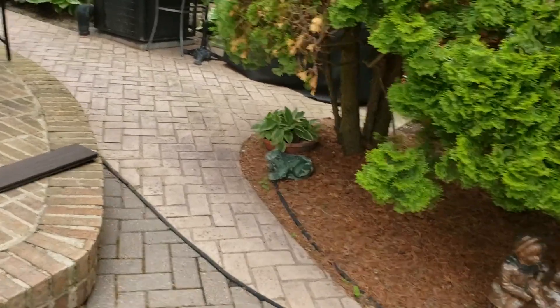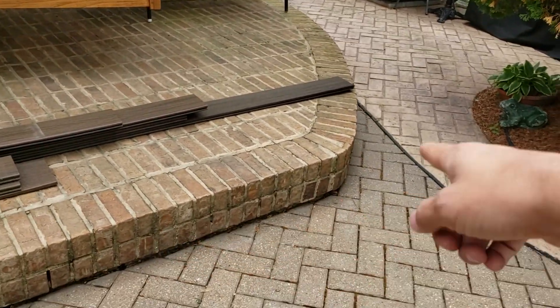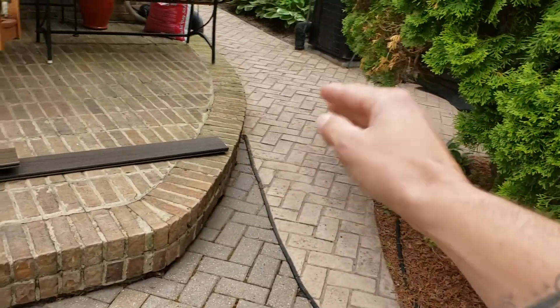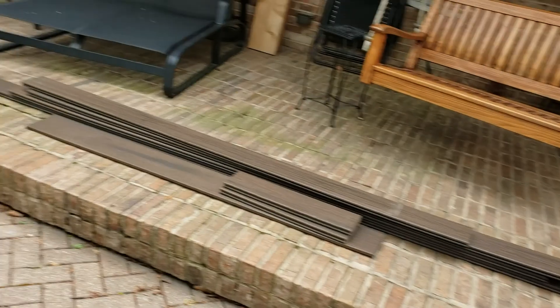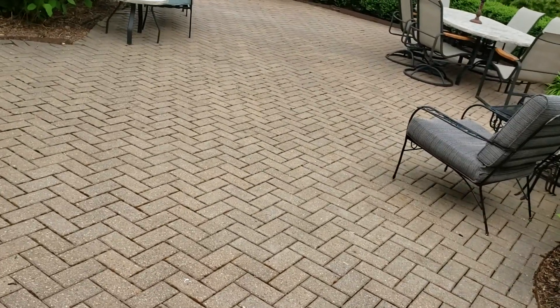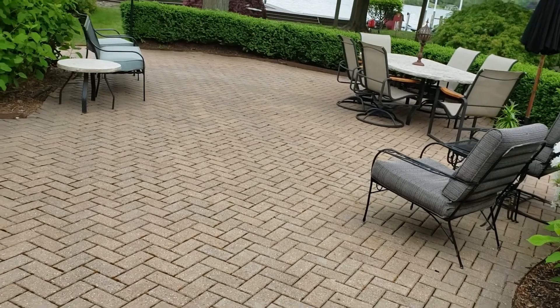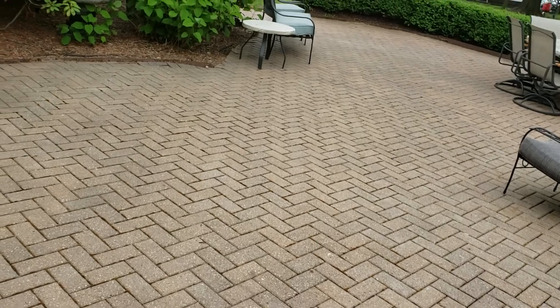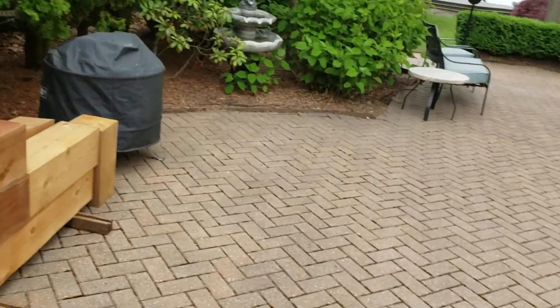If it were me, I would run my soldier course just through here and through here. I wouldn't go all in there — just pave that area the best you can with those pavers. I would straighten this out and do regular herringbone. Don't do this 45-degree herringbone — it doesn't even look 45 degrees. And then this is the whole job.